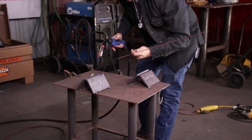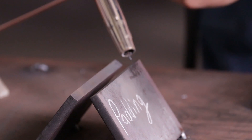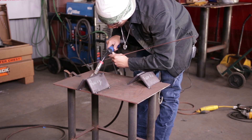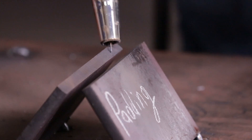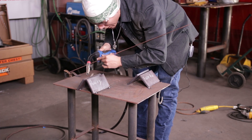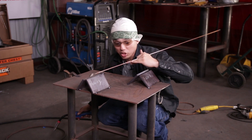I'm running at 17.0 volts and about 195 on the wire speed. What I do is drag the first bead on one side, then drag one on the other side, and I keep doing this until it puddles up all the way so I can connect. You want to run cold — if you run hot like 19 or 20 volts it's going to drip. Keep in mind this is not going to be x-rayed. A lot of times they just want you to bubble-gum it and then weld it out clean.